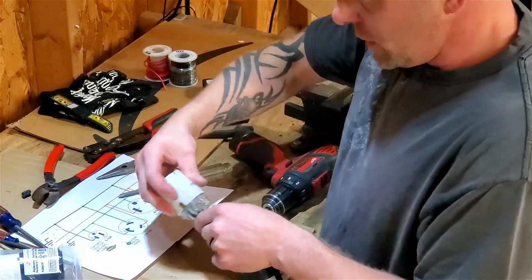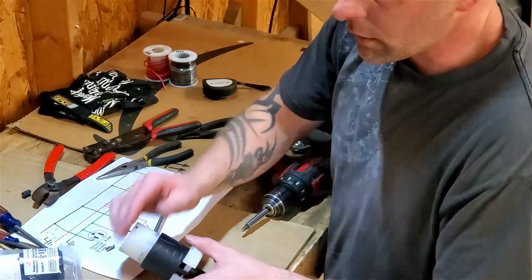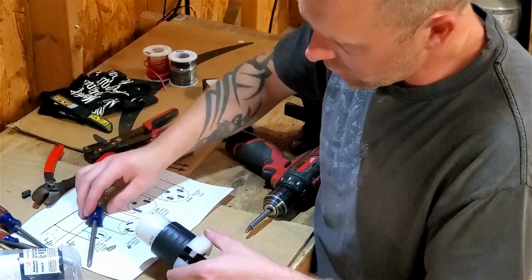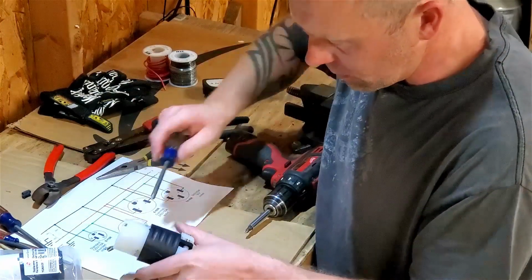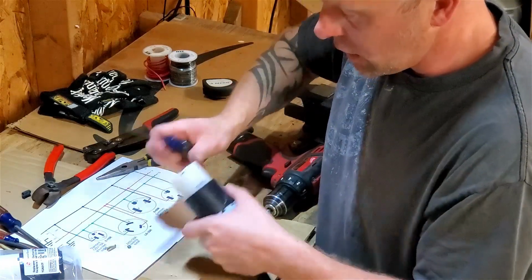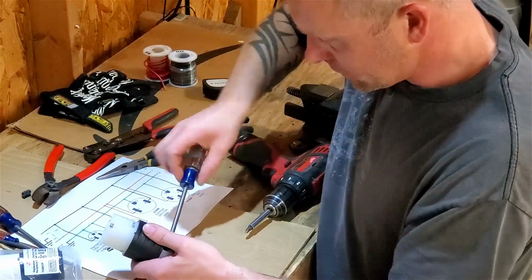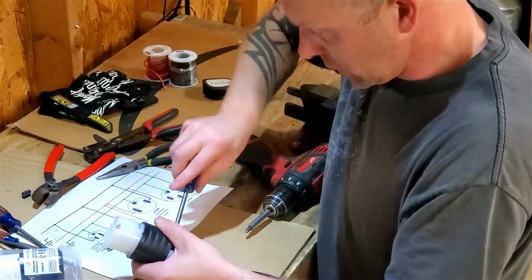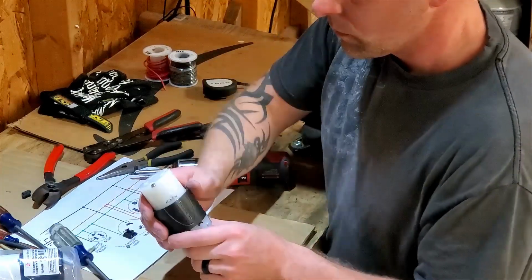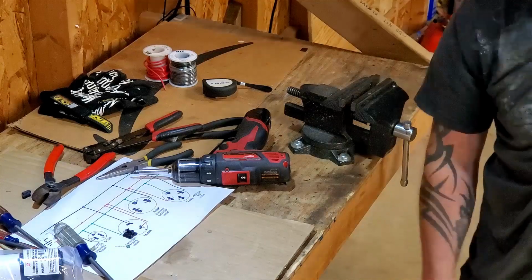Red's Y, which is my white. I've got another reason I like to do these all by hand. Plastic will strip out, obviously, if you use a drill and absorb the torque. In the plastic, you can kind of feel it, and you want it tight, you don't want to snap it or strip it. I'll use a drill to undo it, but. Plug's done. And this cord's done.